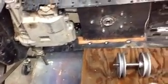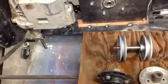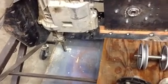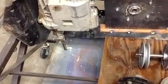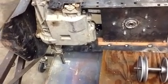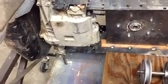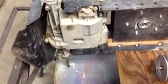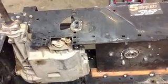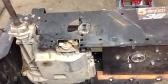The thing is though, once you get this built and you get your jack shaft in and your stiffening plate, you're really not going to change it much. So you do want to decide what height you want to be at before you really start doing this, because to lower them or change that is actually quite a bit of work. A lot of different configuration once you go to move it, because you'll get everything lined up, everything set up, and then now everything's got to be moved an inch one way or the other.